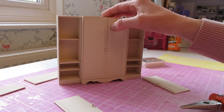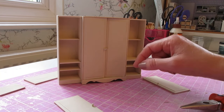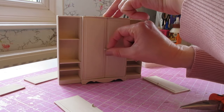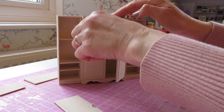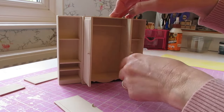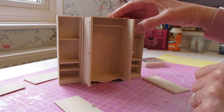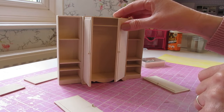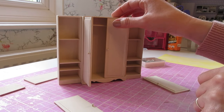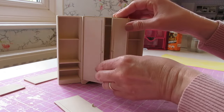If you ever find that your doors are falling in, it just means they're a little bit too small for the opening. What you can do is cut a couple of little pieces of strip wood — just five or six millimeters across — and put them at the top and bottom. That will act as a stop so you'd place them back the thickness of your door and then the door would just sit against it, and you find you don't get that falling inwards.